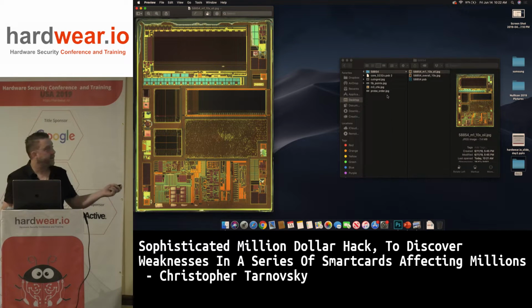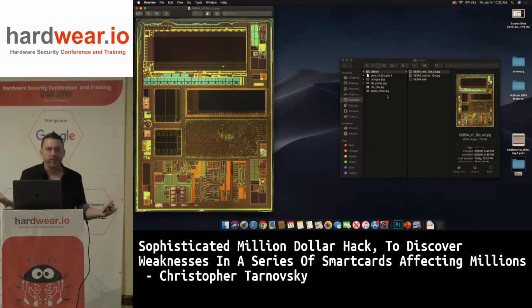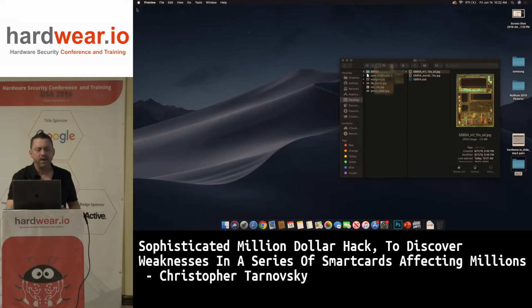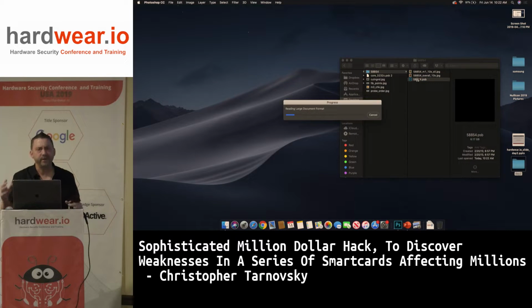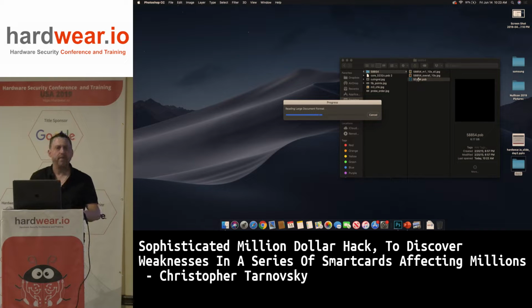However, again, you cut the D15 line, and the chip can't branch because it's a RISC. It's the same thing on these car chips, automotive chips, these RISCs. On this one NXP chip, I had to cut 13 and 15. We were talking about it yesterday, Oliver and I, at lunch. I don't remember why I cut 15 or 13, but I had to cut 13 for some reason. 13 and 15 to make it not branch. And then I just listen with my needles on the opposite side of the cut, and I suck out all the ROM contents or the flash. It just depends what I'm up to.